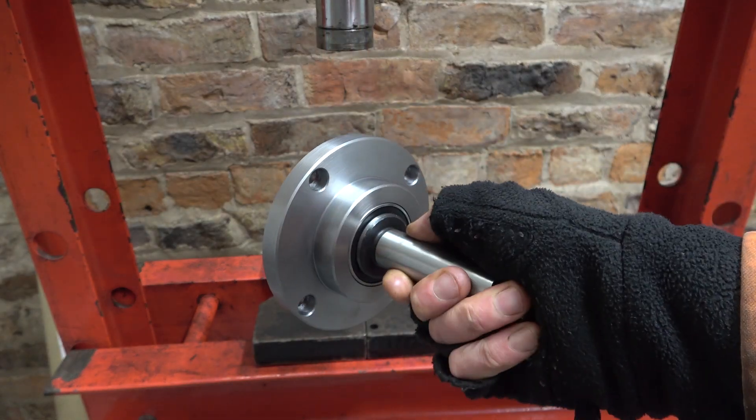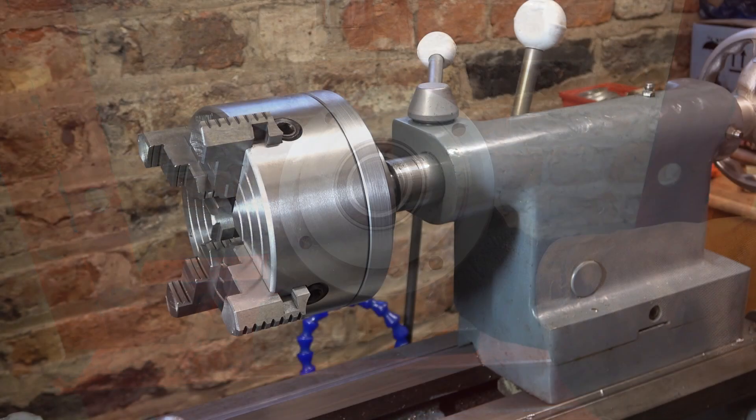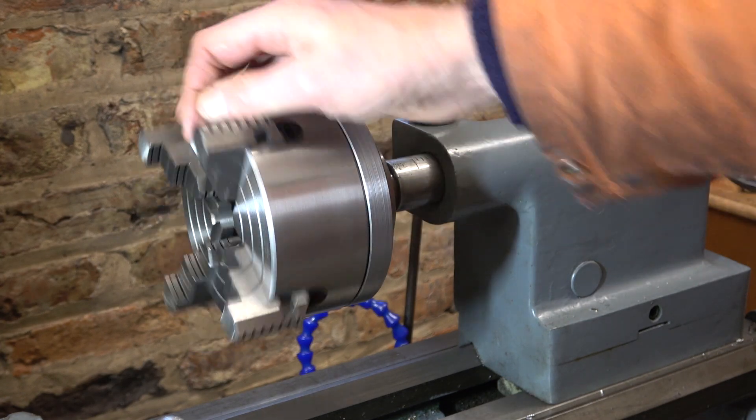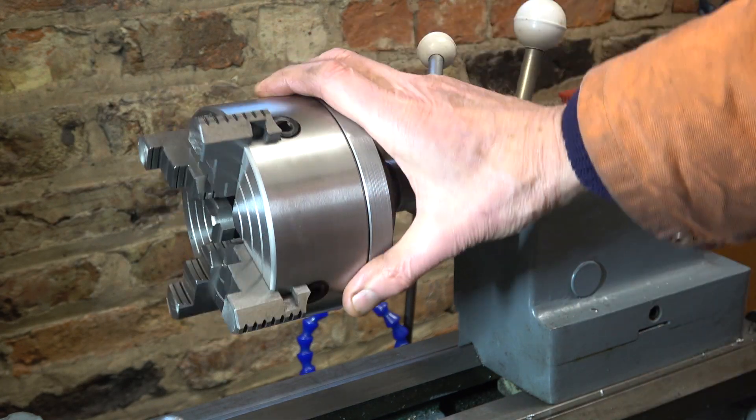There we are — I think that's okay. Put it on the chuck now. I didn't actually say why I wanted to do this — it's so that I could run something eccentric between two four-jaw chucks. I was watching YouTube, and there's a guy called David Wilkes who does some really heavy machining. I saw this great odd-shaped lump of bar set up between two four-jaw chucks, one in a tailstock like this, and I thought, oh, there's a project. So I think it's rather smart, don't you? I hope that was useful to you. Thank you for watching. Haxby Shed.